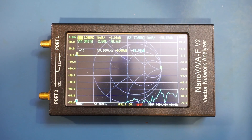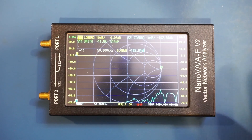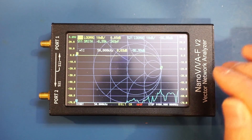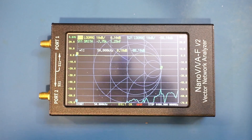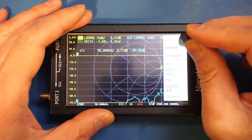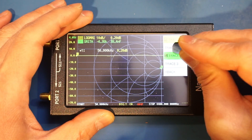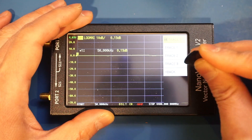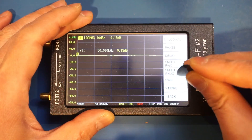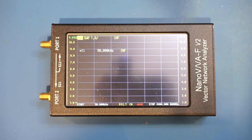Because we don't want to assume anything with these antennas, I'm going to keep the sweep to the span of the entire frequency range up to 4.4 gigahertz. This range had been calibrated before, and the S11 looks flat enough so I'm not going to recalibrate. Because we're only interested in S11, let me turn off the other traces so it doesn't distract us — Display, Trace, Trace 1, Trace 2. Now we're left with S11, and let me change the format to SWR as well. Now let me put on the whip antenna.